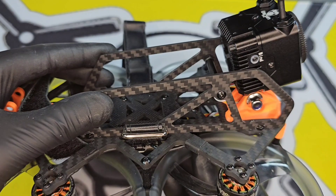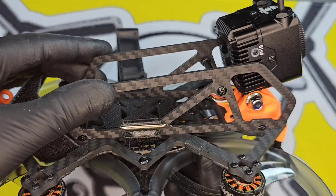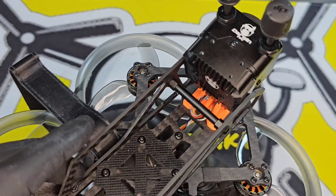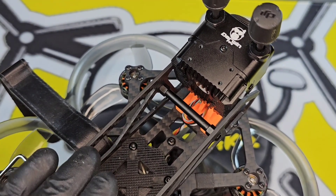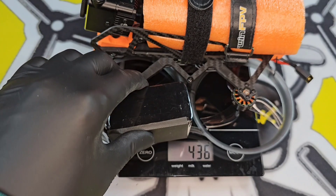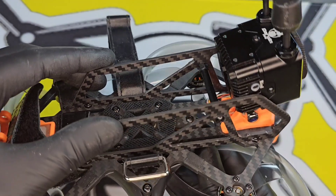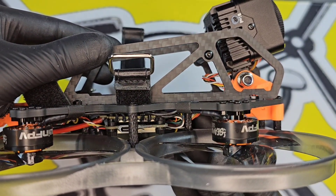Under normal circumstances with the battery on top, the bumper becomes like a protective cage — I would have liked it to be a bit taller so it covered the whole battery, but I think it's a good idea. The bar here stops your camera coming back too far and also stops your battery shooting forward in a crash. The drone weighs 436 grams with a 1300mAh battery, and 654 grams fully loaded. The carbon on top is two millimeters thick and the carbon on the frame is three and a half millimeters thick.